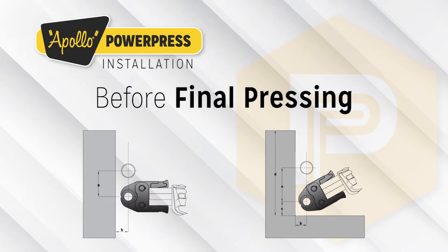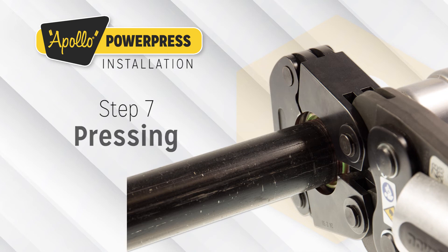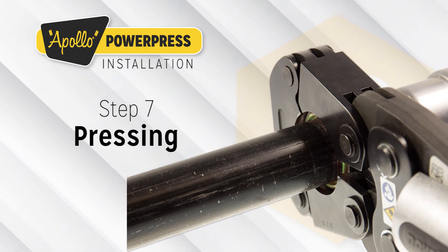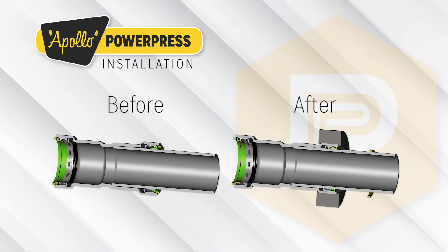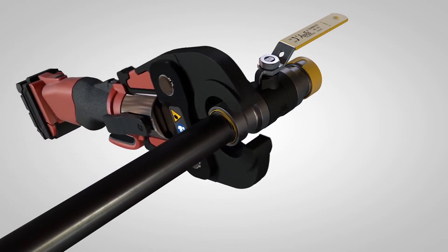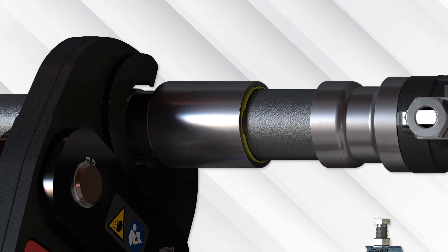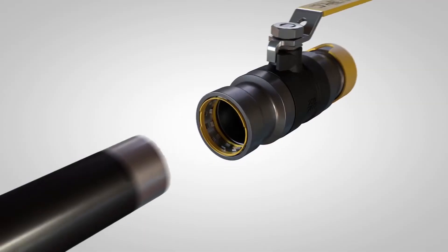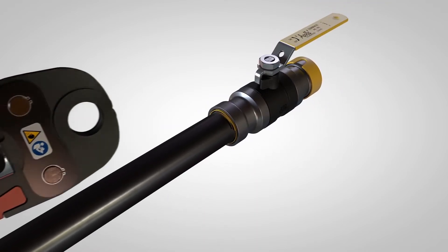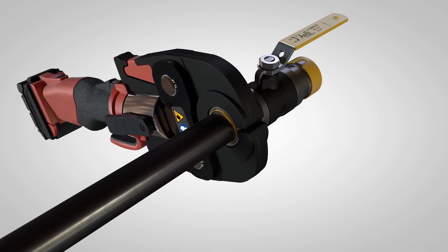Before starting the final pressing process, it is important to check the minimum required distances to ensure that there is adequate room for the press tool to operate. Step 7: Pressing. Press tools consist of a press machine and the corresponding press jaw or sling. Every joint in the system must be pressed in order to achieve a leak-free system. The sling profile that corresponds to the diameter of fitting being installed must be used. In some cases, an adapter may be required in addition to the press slings. Before starting to press, the press jaws and slings must be checked for dirt and cleaned if necessary. The press machine must be in good condition and the manufacturer's instructions must be observed. In order to create a correctly pressed connection, the groove of the press tool must enclose the press fitting O-ring bead. Once the pressing has started, always complete the press cycle and under no circumstances interrupt the process.